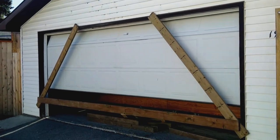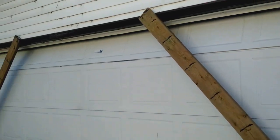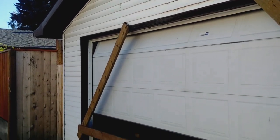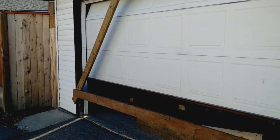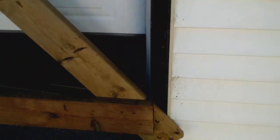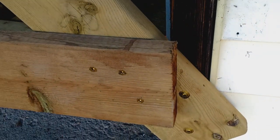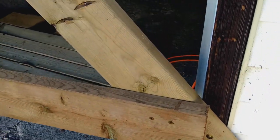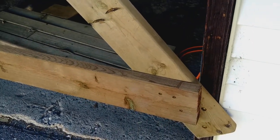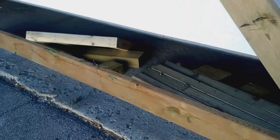On the back side you can see I also reinforced the door. I'm actually going to be leaving the door on through the lifting process, so I decided to reinforce it. Obviously this side is strong due to the beam across the top, but we don't want the walls to wander, so I reinforced them with a number of 2x6s. These are using pretty substantial fasteners made by GRK — about five-inch with a shear rating of about 700 pounds. I also used a smaller fastener throughout, a four-inch called the R4, also made by GRK.